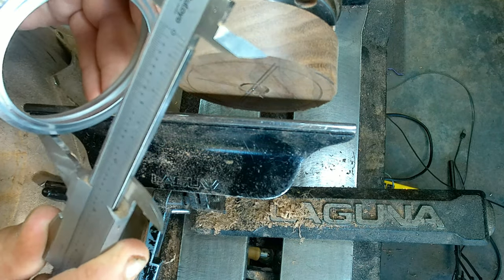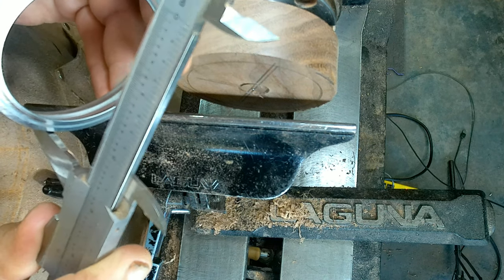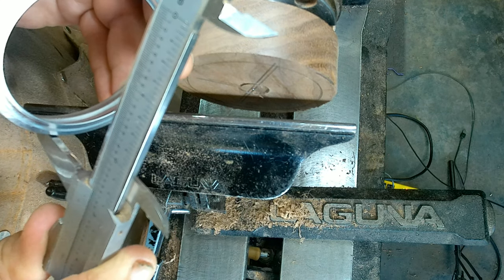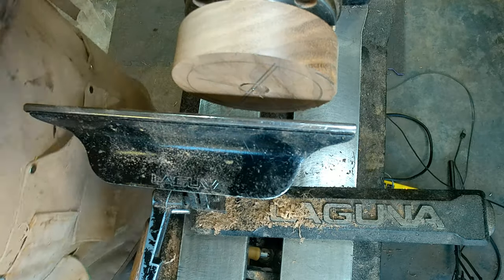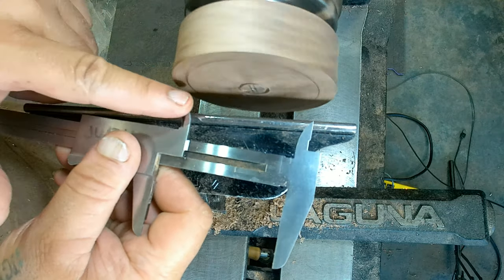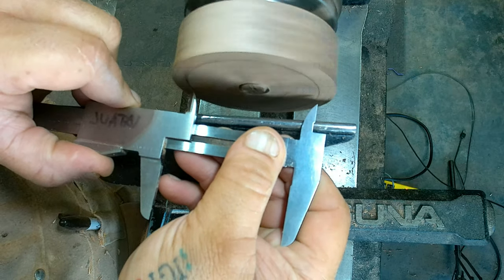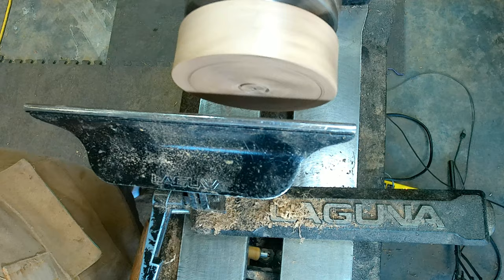I want to take that into consideration because this wants to be a jam fit. Wants to be fairly tight, so that widest width, I want it to be just barely able to pass the caliper. Just like that, it's scraping. That's what I want. Because again, this is a jam fit. Now I'm going to hold this edge, and slow the lathe down, I'm going to hold this edge to the wood, to draw my circle, and that's not smooth, that's not flat. So first, let's flatten that face.